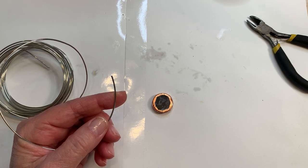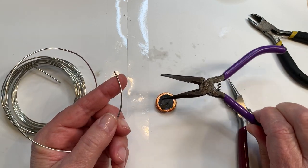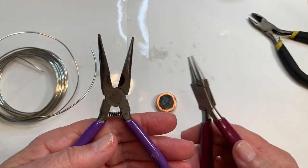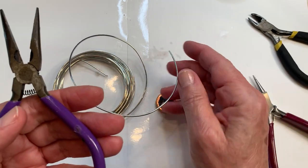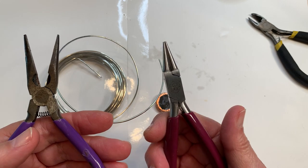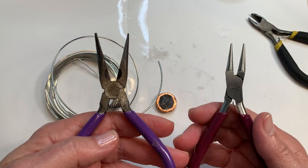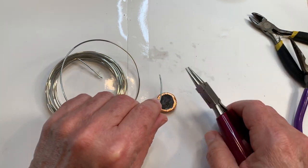I'm going to get my round nose pliers. Typically you have a dedicated plier for this work because flux does a number on pliers. You'll frequently work with other pliers when cutting or shaping — as long as there's no flux involved, it's safe to use your better pliers. But if they're going to be exposed to any kind of flux, this is what you can expect to happen to your tools.